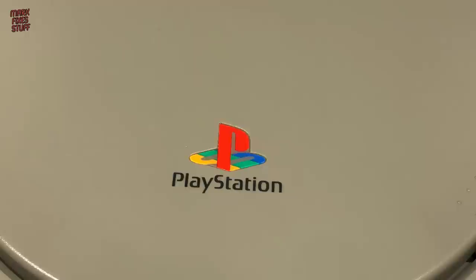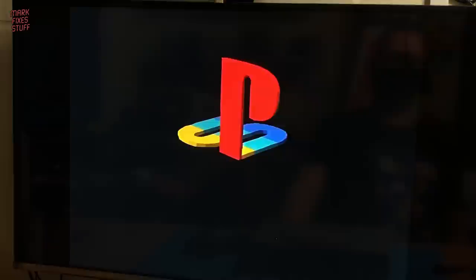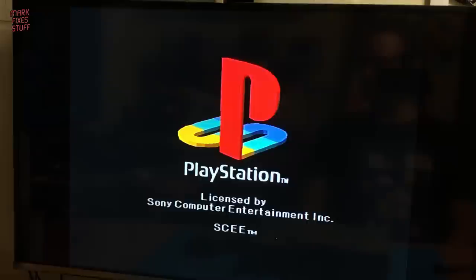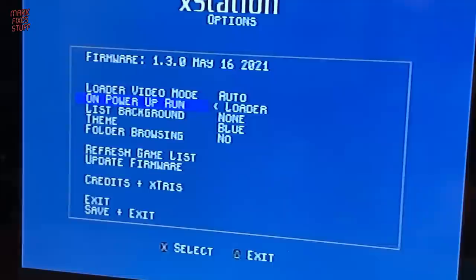Let's power on. The PlayStation boots and the custom code executes on the XStation instead of being read from a disc. This screen means a successful boot and that the menu code is loading. When you first boot with a new SD card, or if you add games to the card, then you'll need to scan the card for titles. Simply press triangle to enter the menu where the refresh option is located. There are a few options in here, but they're well named and self-explanatory.